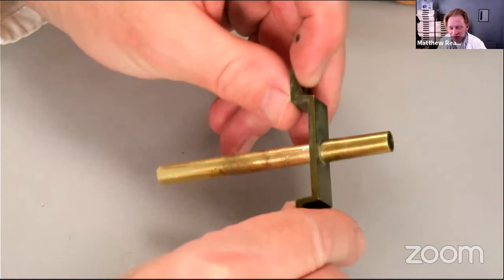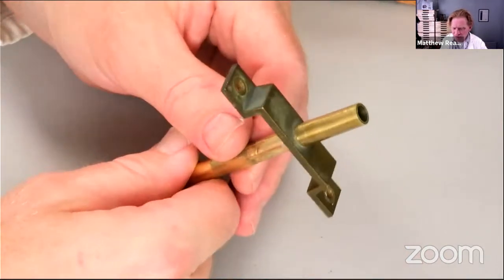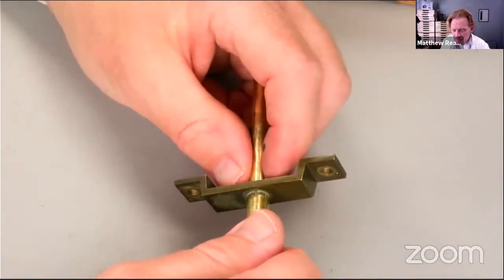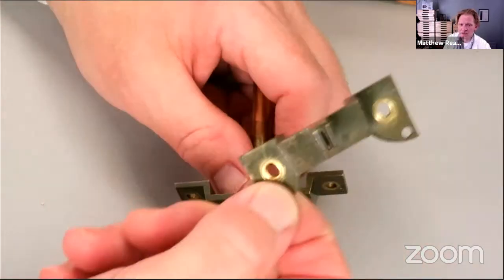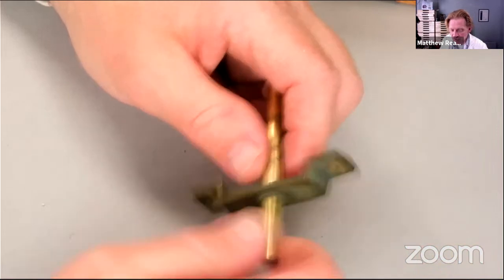The hour bridge is really soft. It's incredible. So we've got to check that that's still flat. Doesn't look bad, but it's just a casting. And so I guess, interesting that we talked a lot about bushing recently, bushing and depthing. And of course, on clocks where you've got a cast back cock like this, in fact, from new, the thing is really soft because it's a bit of cast brass. So that bush is probably one of the ones that wears more than the others.